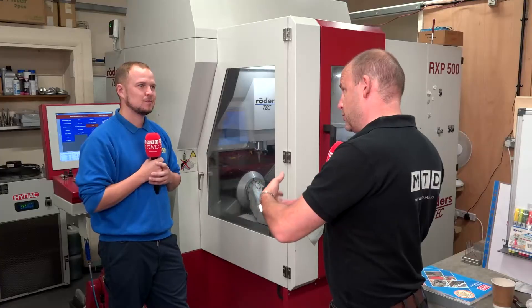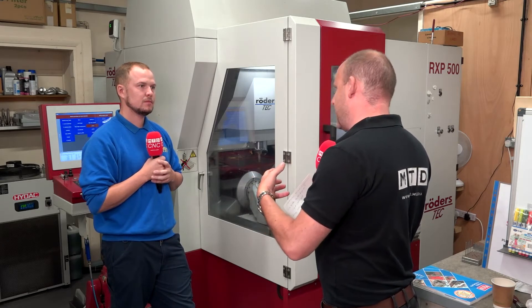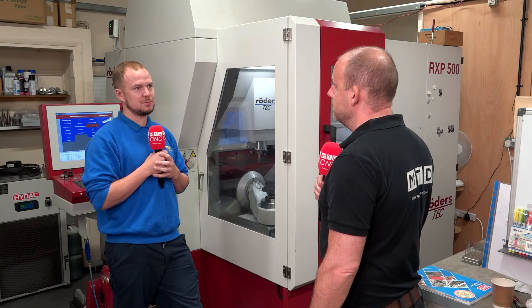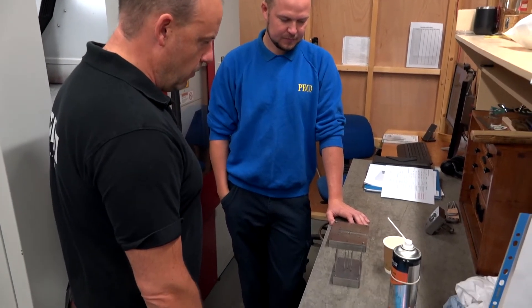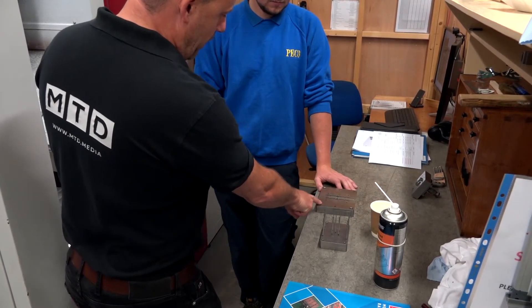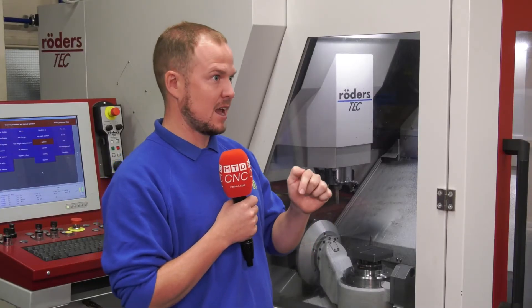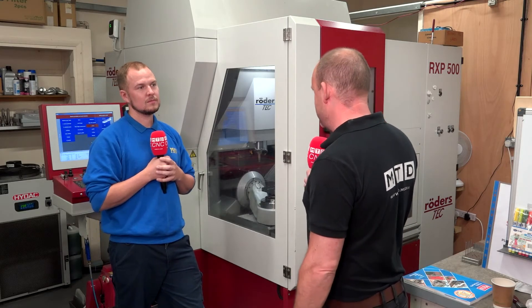You bought this as a five-axis machine, but they are available as three-axis machines. What was the advantage of five-axis, because a lot of the prismatic parts here are just face machining? On a three-axis machine you're limited by Z step-downs — you'd generally work to about five microns to produce a finish to avoid a pyramid effect on the part. With a five-axis machine you can tilt the part over, allowing much larger step-downs and step-overs. The classic example is the point tool we showed earlier — those upstands took 17 hours on three-axis, whereas with this machine it took about one hour. Huge savings to be made.